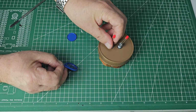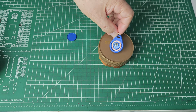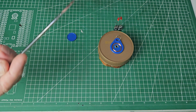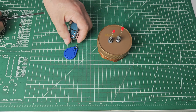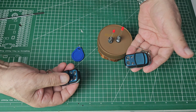How does it receive power? Let me show you with a basic experiment I previously shared on my channel. It's a contactless nightlight. When the coils with LEDs are brought near a power source, they light up, drawing energy wirelessly. The same principle applies here. When the key fob is brought near the reader, the coil draws a small amount of power and activates the chip, which then sends its data to trigger a system action like unlocking a door.